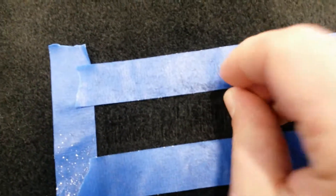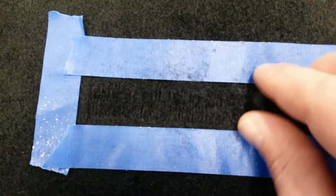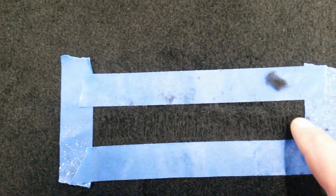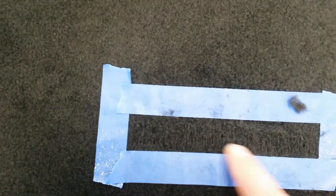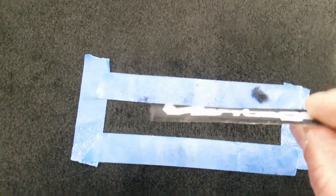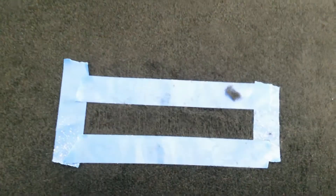You can see how when you're doing it with the clippers, you'll get all this fuzz. It goes pretty quick if you have a sharp blade. You want to leave some of the carpet fiber there so the glue will stick to it and stick to your patch. You recess it basically the width of your patch so it sits flush and a little bit recessed — that makes it easy to clean up.